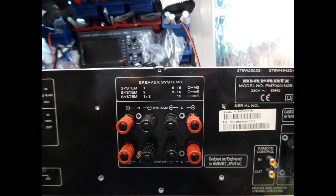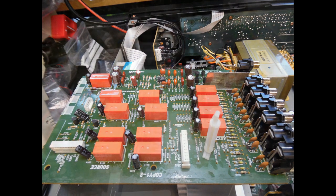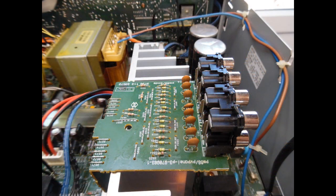Working from left to right: first is the input selection board. This being a higher-end amplifier, it uses precision relays to select inputs. I check the RCA input sockets — you'll often find dry joints on them — and also the inter-wiring cables. I reflow all connections on that board, clean it off more closely with a brush, do a visual inspection, then set it to one side.